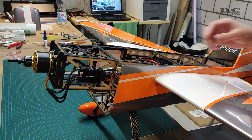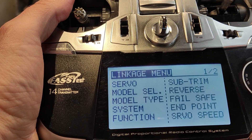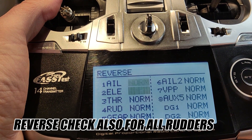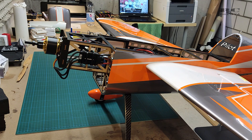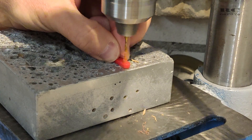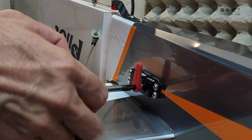I did the first check on the ESC and it wasn't okay — it was going into programming mode with the throttle stick at the bottom position. When it does this you hear a specific sound, and you need to reverse your throttle channel to make sure the ESC works properly. The second check showed everything was okay — it counted the cells and was ready to spin up. Then I drilled the servo horns to make the M2 screws fit perfectly, and installed the servo horns at the zero position of each servo.